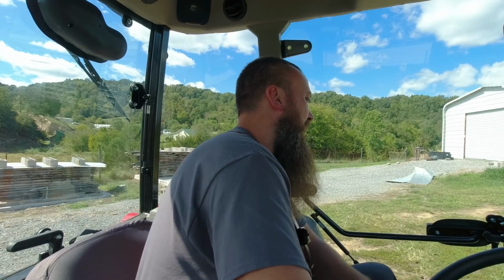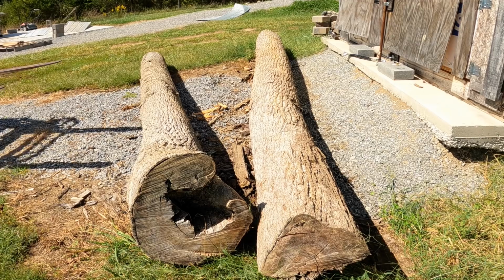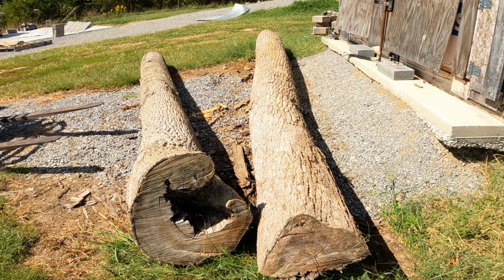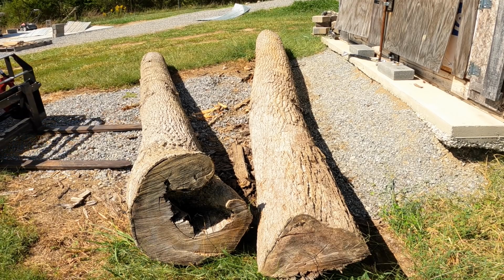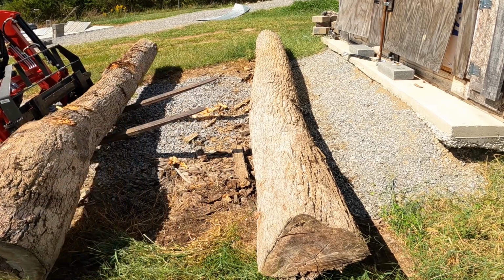You just do a gentle little push on the forward or the back, and you can ease into stuff like I'm doing right here. A gear-driven tractor or a shuttle shift or your old school tractors, it's hard to do stuff like that without riding the clutch. So for loader work, this hydrostatic transmission, guys, is the way to go, I tell you. It's awesome. I've had gear-driven tractors, and they do okay, but this hydrostat is just so much easier.